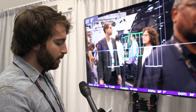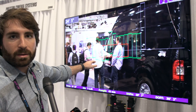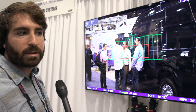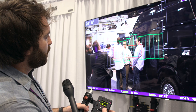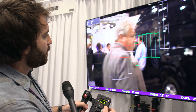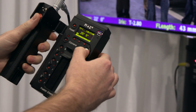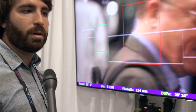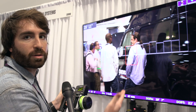The second mode is the autofocus mode, which you toggle here on the hand unit 3. In the autofocus mode, you can select which rectangles you want the lens to autofocus to — it's going to range to the closest distance it measures in the target zone. Using the directional pad on the hand unit 3, you can move that target zone left or right. Using the up-down arrows, you can decrease or increase the size. The Light Ranger has a set 18-degree field of view, so as you zoom in or out, the bars scale accordingly to show you what you're actually looking at in the frame.